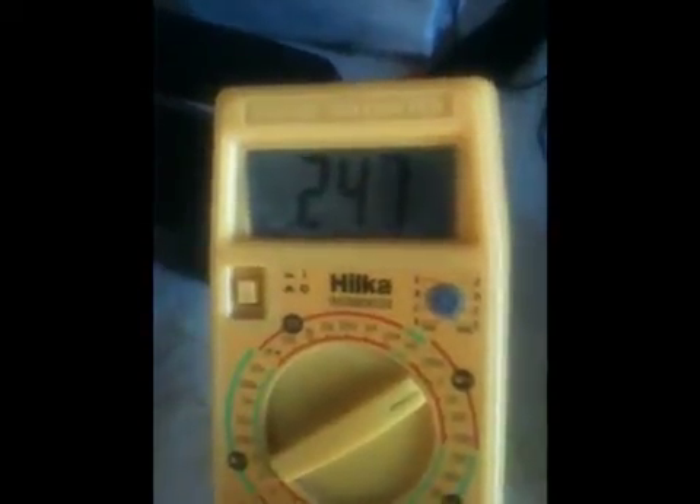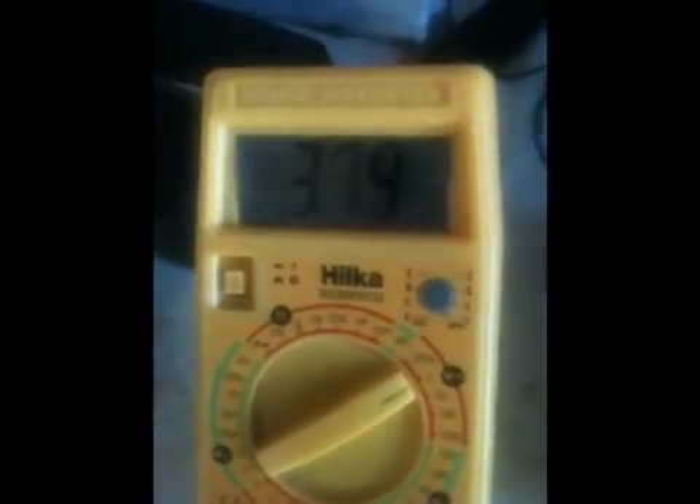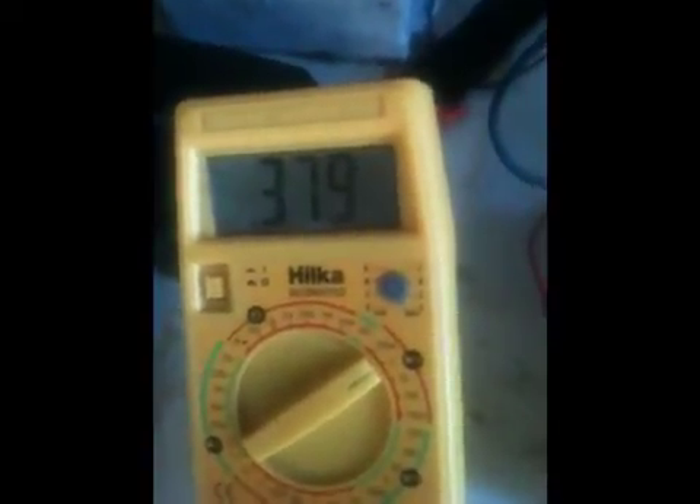At the moment it's set at stock, as in no voltage change — resistance is high. Turn it clockwise and there you go — we get 37 millivolts. Turn it some more: 43, 65, 70s, 80s, 100 millivolts. That's just about a quarter turned. If I go halfway, halfway is 247 millivolts. And a bit more — three quarters of the way gives 379 millivolts. Fully around gives you 532 millivolts.